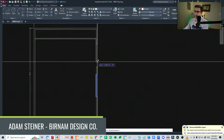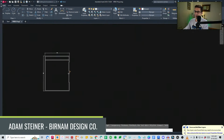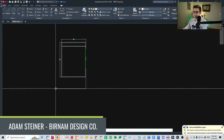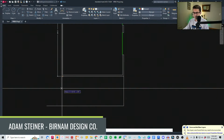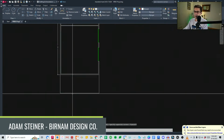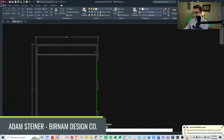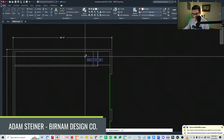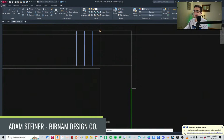It shouldn't take me too long to recreate that first floor because it's pretty simple. We're just going to have an entry area, a porch, and stairs in the back. All right, so I'm showing a 12-foot porch off the front, going all the way across. Stairs off the back. Those stairs are 42 inches wide, and I'm showing 10.5-inch treads. Gives me a little wiggle room, flexibility.